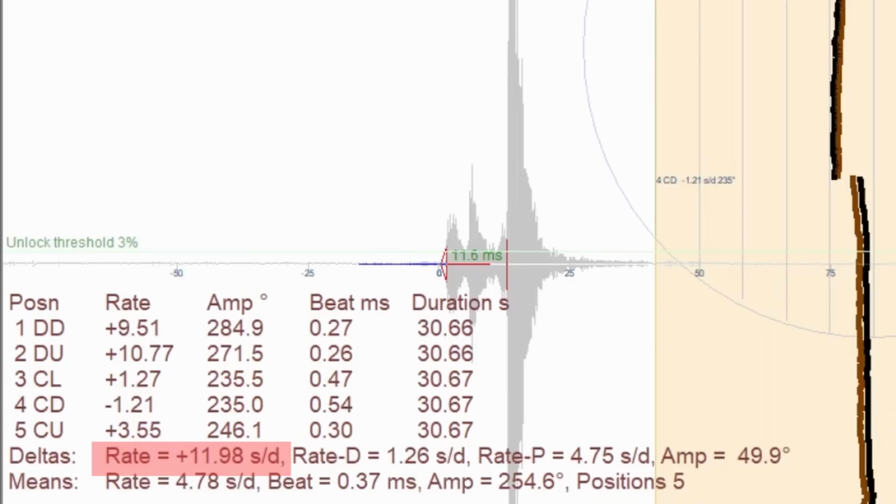So we're good there. Now, for a watchmaker, the delta rate is the most important number that we look at because it's a direct indicator of the overall condition of the movement. If your delta rate is too much out of there, that's telling you that there's a fault in the movement that needs to be corrected before we start regulation.